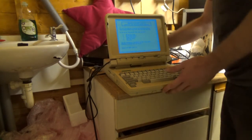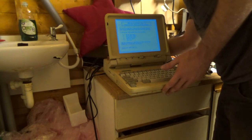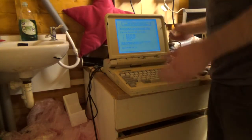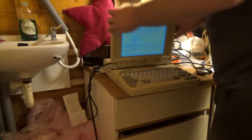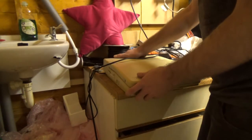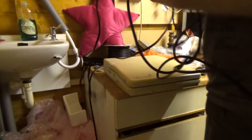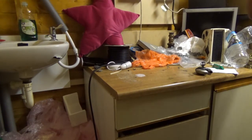The cells were freezing cold, which to me suggests none of them had gone in reverse. You can get reverse charging if one of them had discharged unevenly somewhere in the past. You can get it with older battery packs as the cells start failing. The regulators got a little bit warm towards the end, but it was just slightly above ambient temperature to the touch, and it was very cold out there.